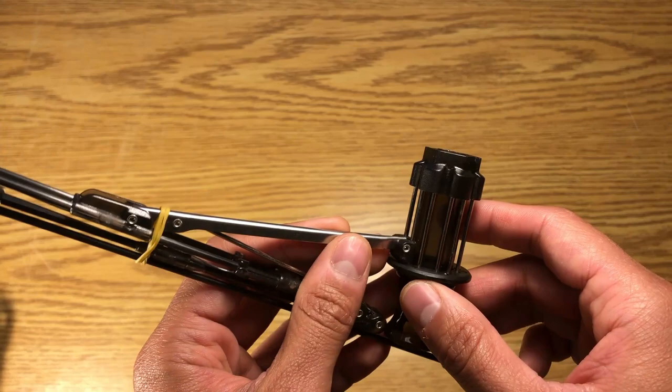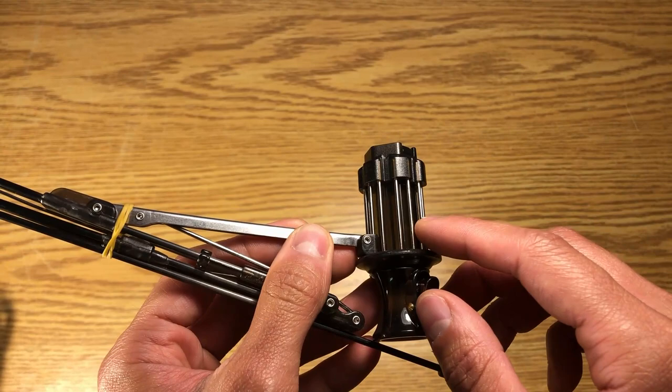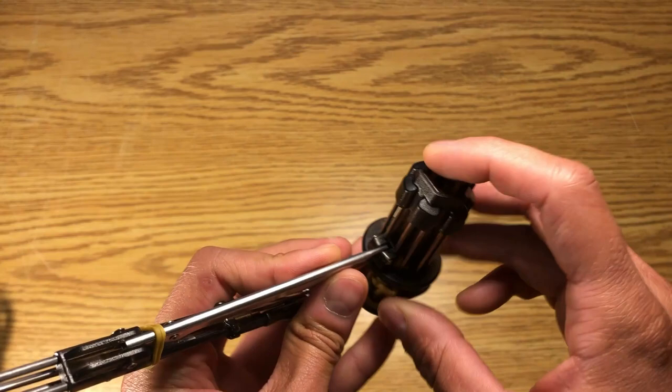It's just that it's very difficult to manufacture and the reliability wasn't really there, especially if there's a lot of friction in the system. So in order for it to be easily manufactured and have high reliability without too much excess friction on the rails, we decided to change it to a shuttle and rail system.